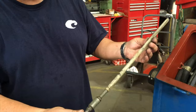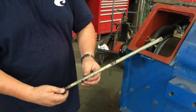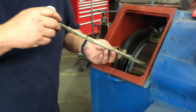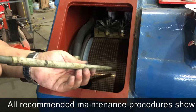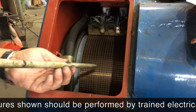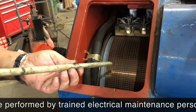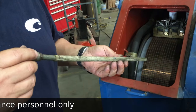If you can get an air nozzle with an insulated tube, you can reach into the motor and blow it out — blow all the carbon out from between the mica segments on your commutator. This will also help cut down the arcing and sparking, and it's what you call air curing a commutator.